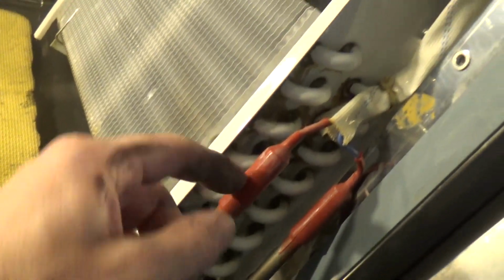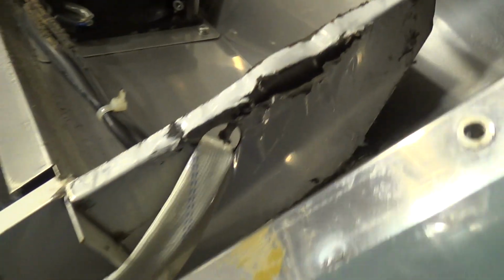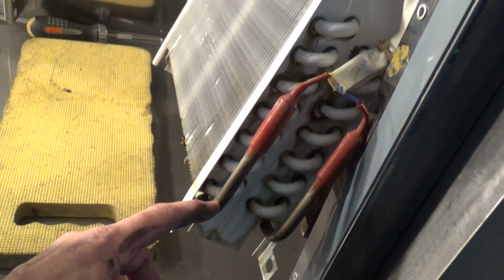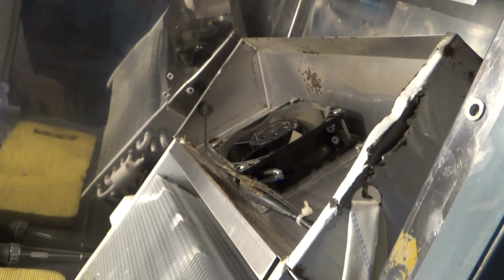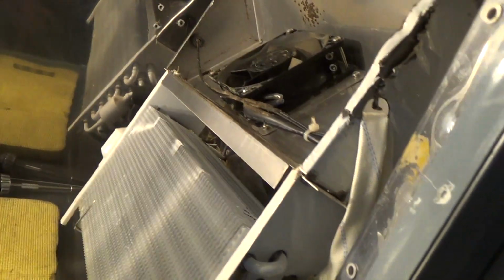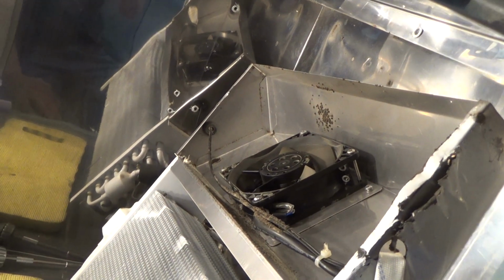I've moved the grommet on the cable so we can push a bit more of that through, because we've got a defrost heater, fans and the sensors all come through that little gap, so you have to get that out, get the heater off. And then it's very fiddly, there's a couple of nuts and bolts on each end holding the top cowling on for the fan, which I expect in the factory they just put the whole thing up, pulled all the wires through and then joined it, because it's got these plugs on it. But I usually try and leave this piece in if you can.